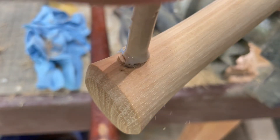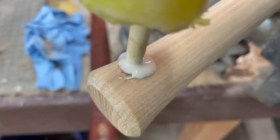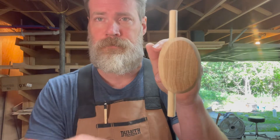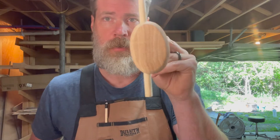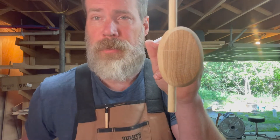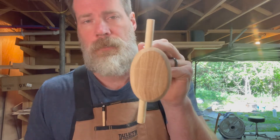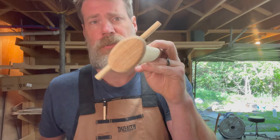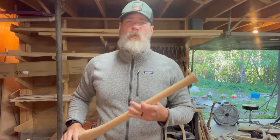I probably should not have used my impact drill to get that in there, so for dowel number two we're going to tap it in — we're all learning. Give it a couple of taps. All right, we've got our dowel in. You want to wipe off as much of the excess glue as possible — just less to clean up. You can see there's the crack and there's our dowel; it's going to prevent that crack from opening up anymore. I'll come back, let this dry for a day, then trim it and show you a finished product.